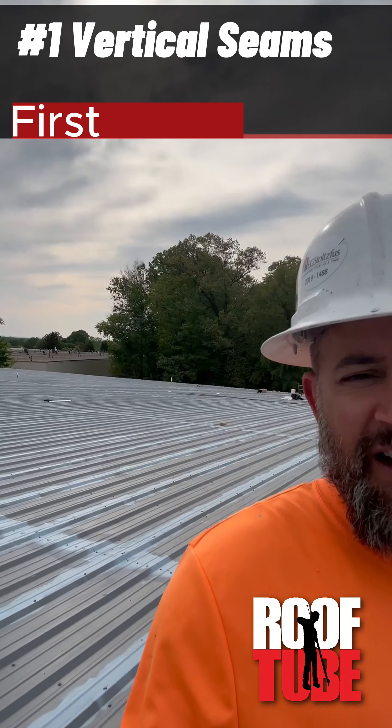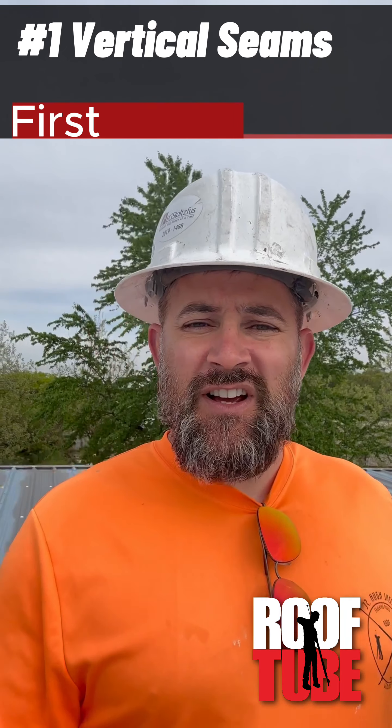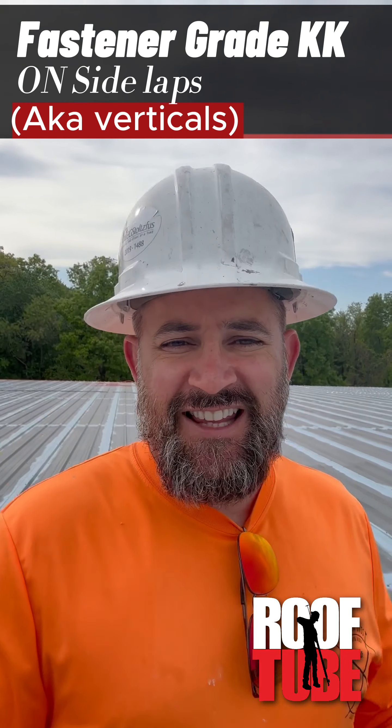The first thing I love is when these guys have their base coat down with their spun flex in. I like to get those seams addressed first. If I've got a bunch of fasteners that are wet and curing up on this roof, I don't really like my guys walking and stepping in the fasteners that we just did — super easy to do whenever you're trying to lay out spun flex and spray that in. So first thing: obviously pressure wash, prime it, get those vertical and horizontal seams done first. After that, the first thing I like to do is seal the fasteners on the stitches of the metal — so the side laps of the metal. I like to hit these stitch screws first.